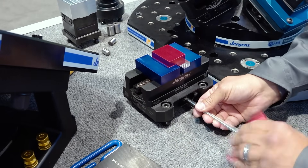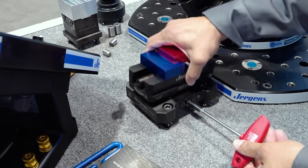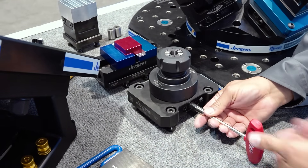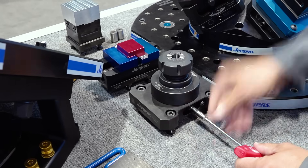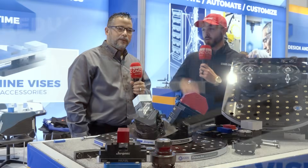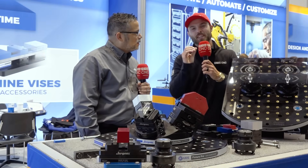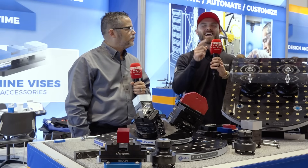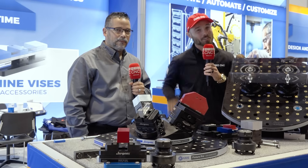And that repeatability has been mentioned multiple times — it really doesn't go without saying. How important is that to operators around the industry? Repeatability is how you're going to minimize your scrap. If you have a tight tolerance job that you're running, you want that repeatability going from fixture to fixture, part to part, vise to vise — within plus or minus 3 tenths, plus or minus 5 tenths. So everything we're hearing today is about optimizing your five axis capabilities with work holding that works for you. Hey everyone, this is Eddie hanging out here at Jergens at MTD-CNC. We'll see you next time.